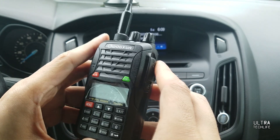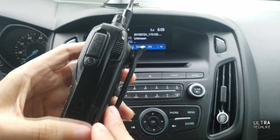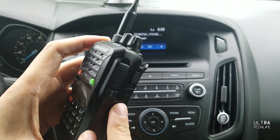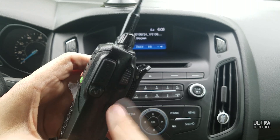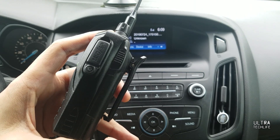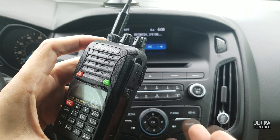Overall it's a pretty cool VHF/UHF radio at about $100 — great budget radio with really dirt cheap accessories. You can't beat the price. It's not top-of-the-line in receive, transmit, or functionality; it doesn't have APRS, it's not digital, it's analog only. But it definitely does the trick for prepping with all those cheap power options — the battery eliminator, the AA battery pack — and the cheap universal accessories. Great for prepping and Skywarn.